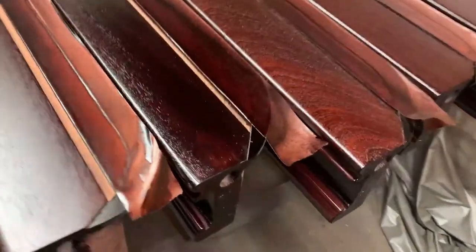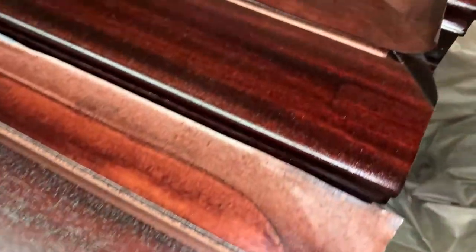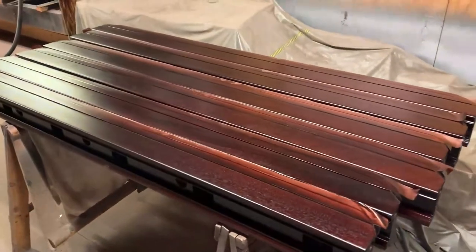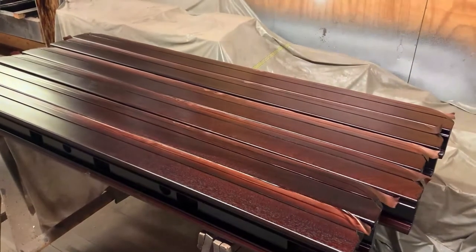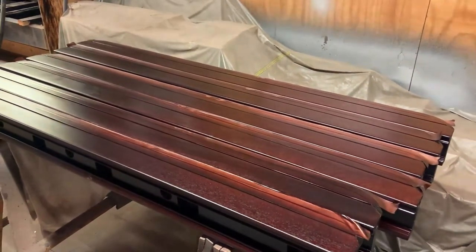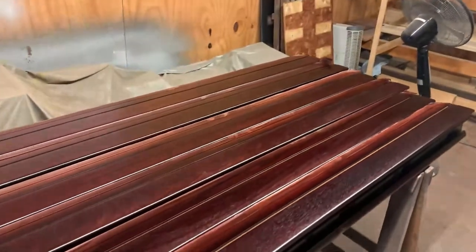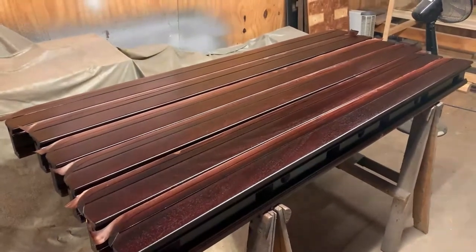That is the first patch repair what we did, what's come out quite nice. That's the second one. Okay, so the next job is to give these cushions a coat of 40% lacquer. Though I'll give them 2 coats, I think, looking at these. Use 40%, it's like a satin finish, which naturally glosses up over time. And these will come out very nice. Okay. Next job is to apply the lacquer.